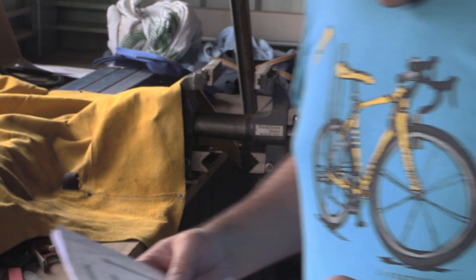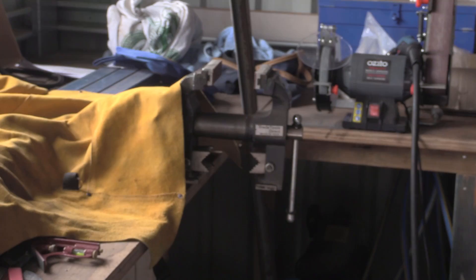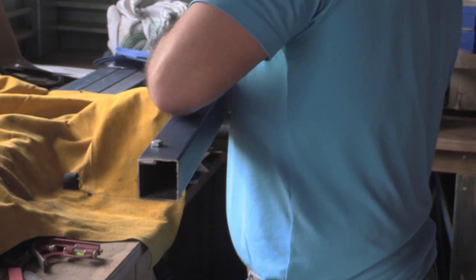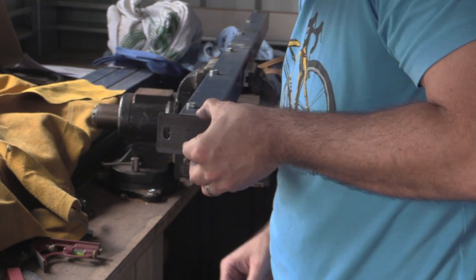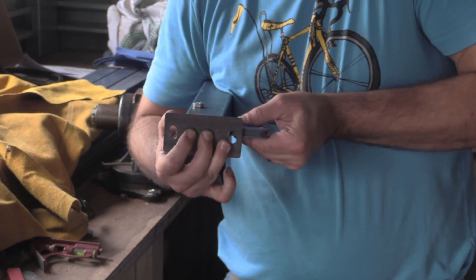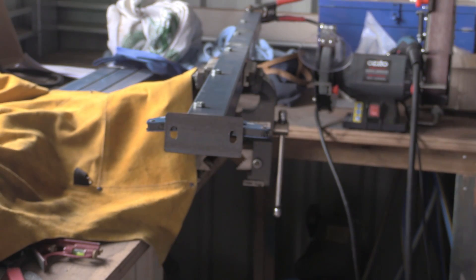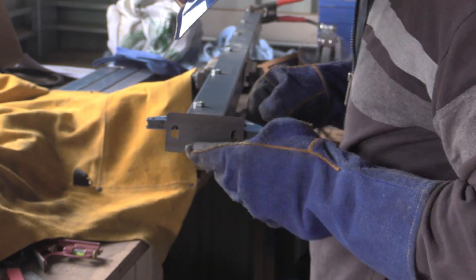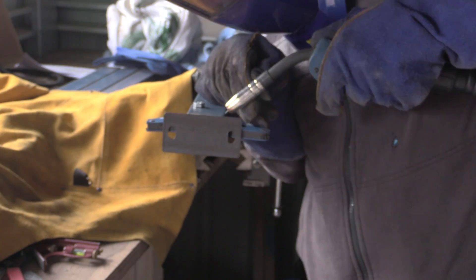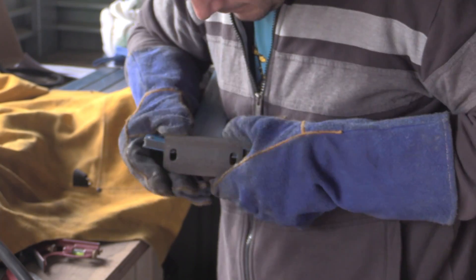Okay, so that goes on top of part number 0056. I've played it a little bit smart and numbered all these off the actual plans — all the pieces of steel — so I wrote on them with a Sharpie just to make sure I don't weld the wrong piece into the wrong position. What we're doing now is squaring up that end bracket — that's where the cable arm that actually hangs over the middle of the table is attached to. I put her on first time and she's definitely not square, but luckily that first tack was very light and I was able to peel it off.